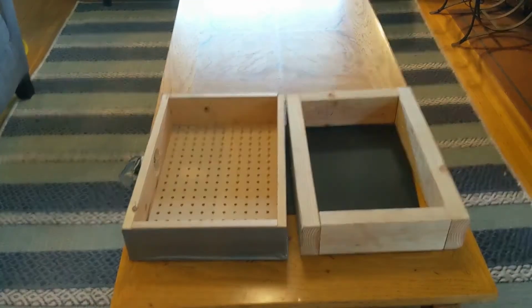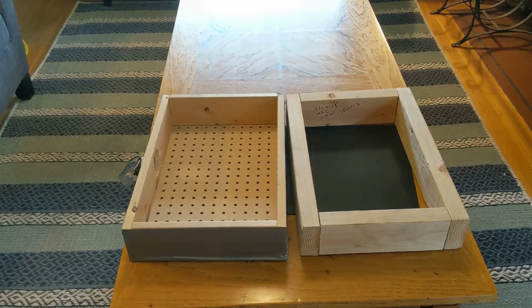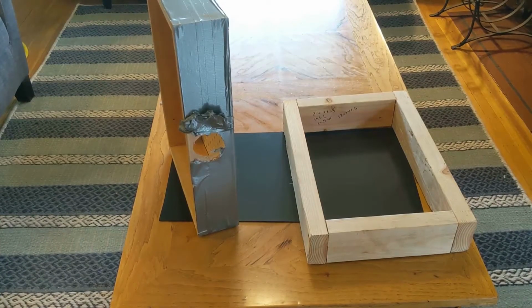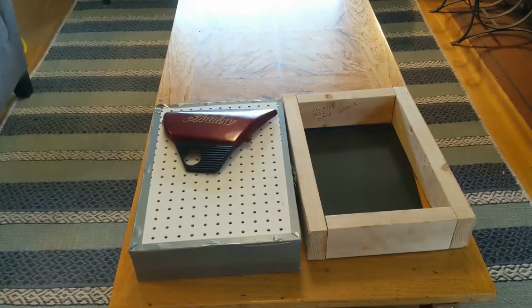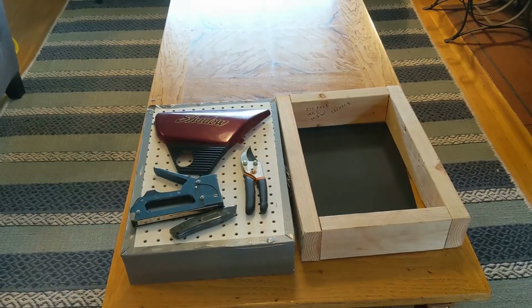First, a thin sheet of plastic. I used ABS. You'll also need two wooden frames. One you will mount the sheet of plastic to, and one you need to attach pegboard to. The frame with the pegboard should have a hole in the side big enough for a vacuum hose to fit through. I duct taped this frame to make it more airtight. Lastly, you'll need the thing you want to make a mold of and the tools to mount the plastic to the frame and cut the plastic.